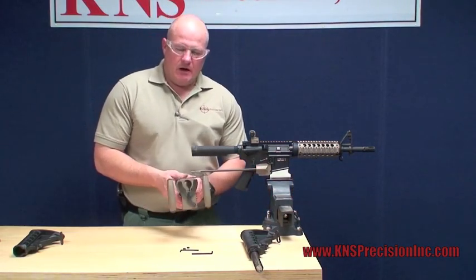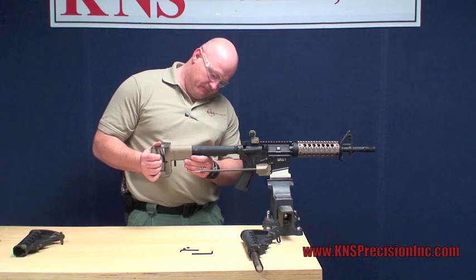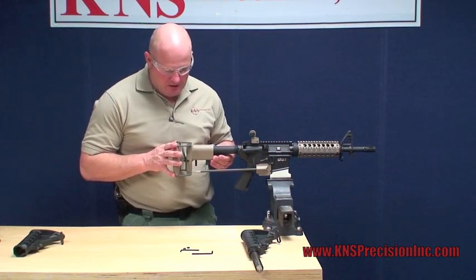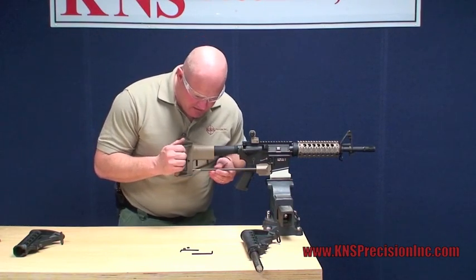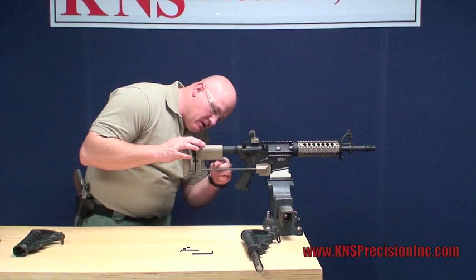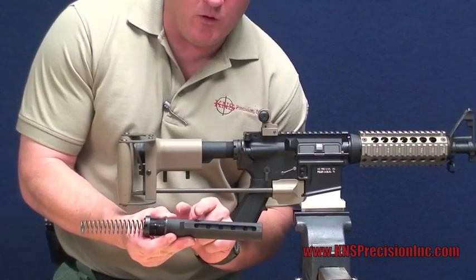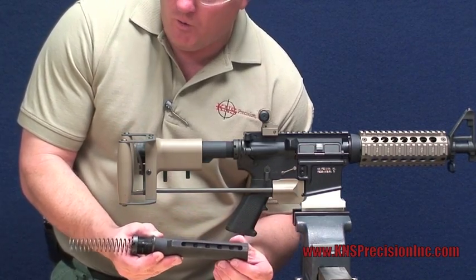Next, we're going to take our handle with this butterfly activator assembly, and slide it on the back here. There are 2 screws in the bottom of this assembly, and we're going to slide them up all the way until those screws line up with the holes. As you see, I'm guiding this trigger rod into this assembly. Once we get this up, we're going to take our Allen wrench and tighten these screws up. As you can see on this tube, there are multiple holes in here. You need to get these screws lined up to where when you install that screw, it goes into the hole.